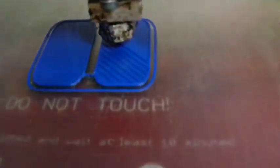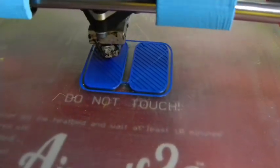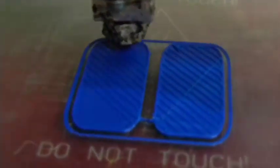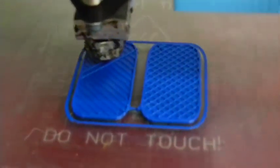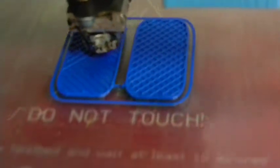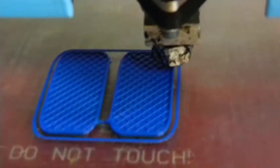Okay, there we go — there's the 25%. I don't know if I can zoom in on that or not but I'm going to try. I guess it won't quite focus really well there. That's what a 25% infill looks like — you get a hatch pattern. We'll do that all the way up through the solid parts, with solid walls outside and it infills that way.